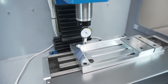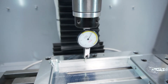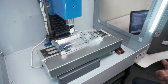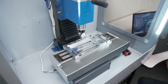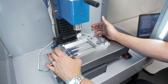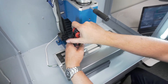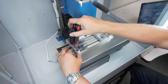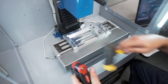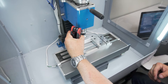Tap the dial to make sure we're good, then jog back and see where our error is. You can repeat this several times before a vise is properly aligned. We're now 15 thousandths from end to end. Typically you want to split the error, but since I've already got this bottomed out against the edge, I'm going to loosen up the lower left and give it a slight adjustment, then give it a nice little love tap with our fine adjustment tool.